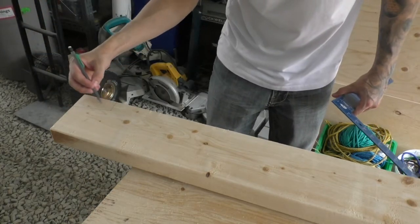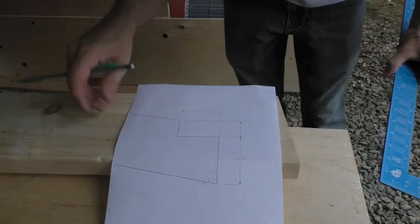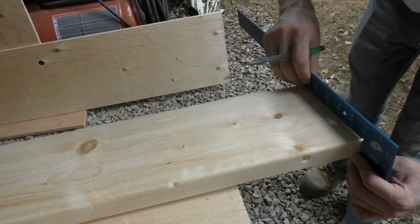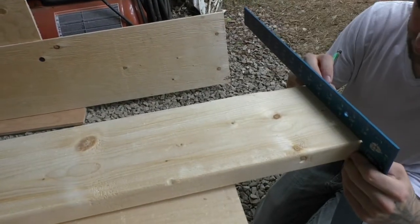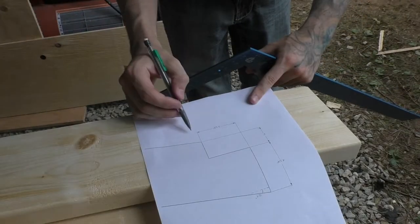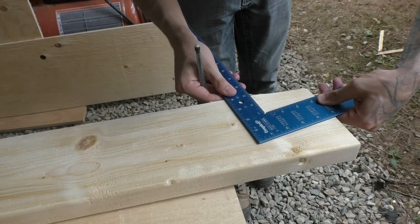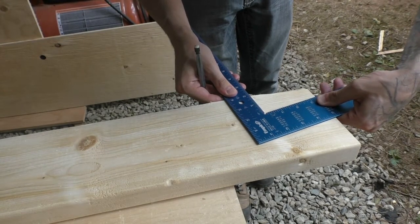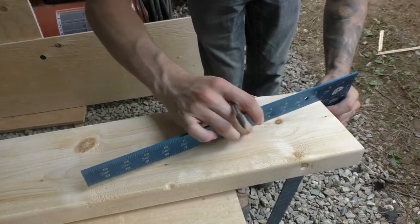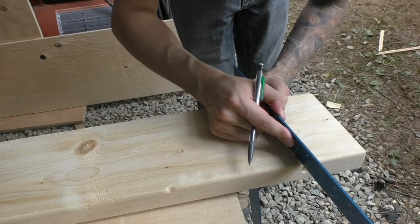This chunk will be cut out. Looking at my designs, I need four and a quarter down from there. Measure on here: four and a quarter, just a little tick at the edge. Three and a half in and two inches down. Three and a half — line it up with the tick. Two inches — line it up with the edge of the board, and draw some straight lines. Confirm those measurements: three and a half, two inches — and that's ready to be cut.